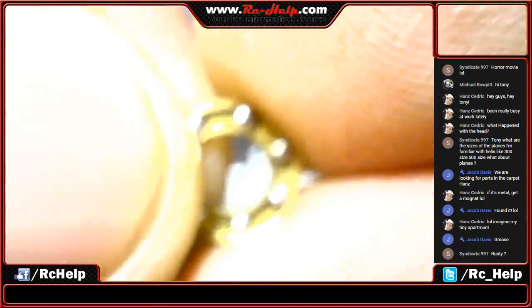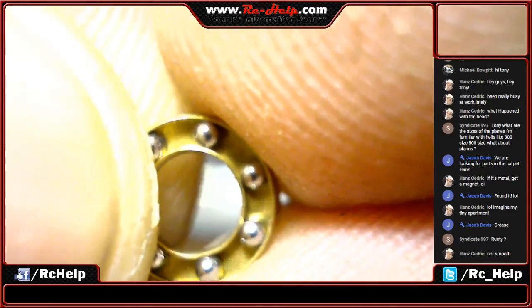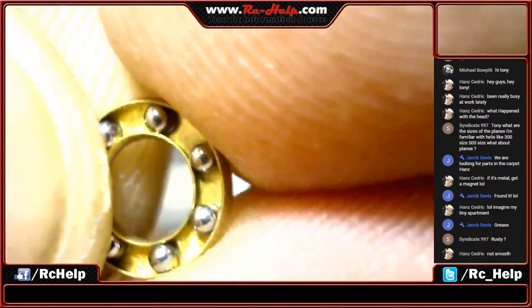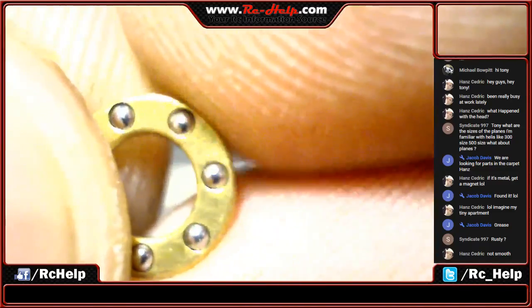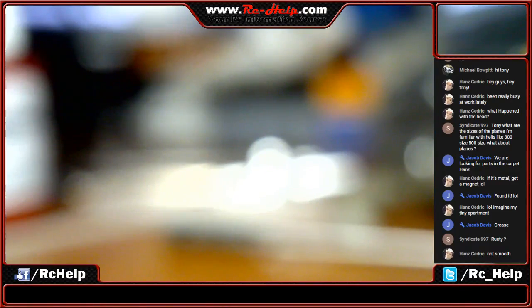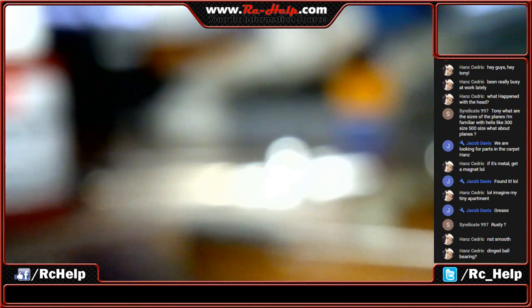There's no freaking grease. There is absolutely no grease in this thrust bearing. And what that's going to do is basically it's going to overheat and it's going to prematurely wear it out. It may not overheat because they actually don't move much. But ding ball. Did you actually see a ding? I didn't see a ding in any of the balls.